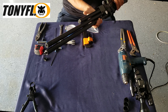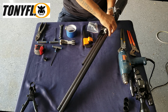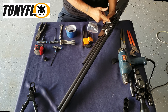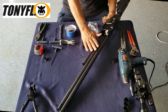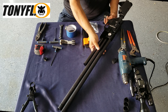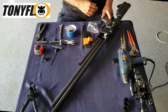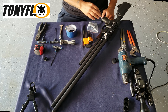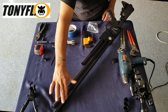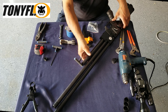Let's unload this gun, make sure we're not loaded, and put it on safety. We're not touching the air cylinders and this gun does have air in it, so be cautious. We have no rounds in the gun and it's on safe. Now I'm going to remove the barrel shroud.